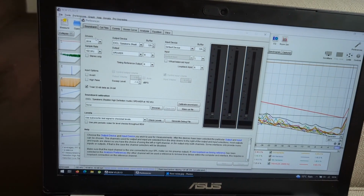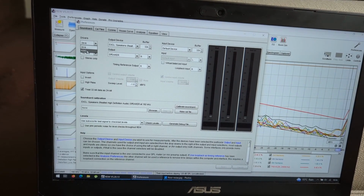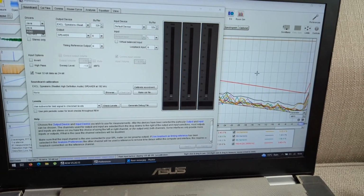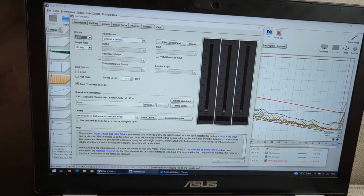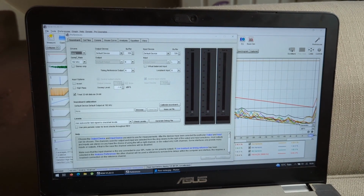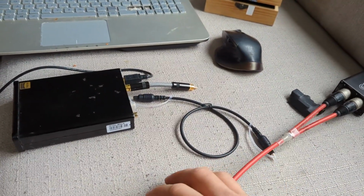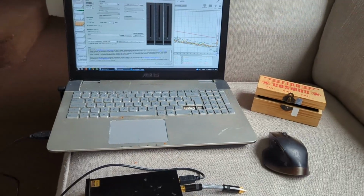So I am limited to Java drivers instead of ASIO, and I know from testing the Focusrite that ASIO drivers perform better than Java. But even with that, this comparison that I did here was Focusrite on ASIO versus both of these on Java. If you know an option how I could use both of these on ASIO, the Topping and this one, please comment below, because I don't know. I haven't figured out a way yet. But so far, even on Java, I get 10 dB better performance compared to the Focusrite. So yeah, let the testing begin.